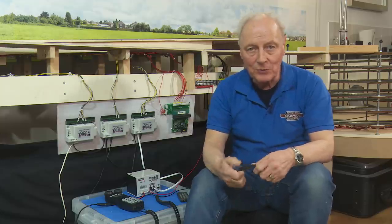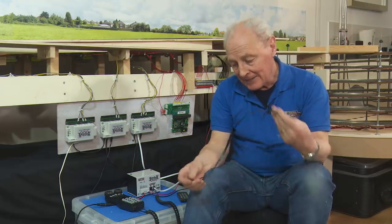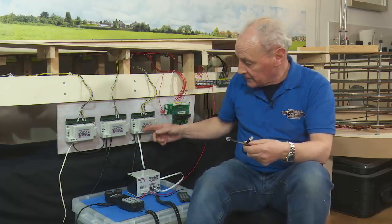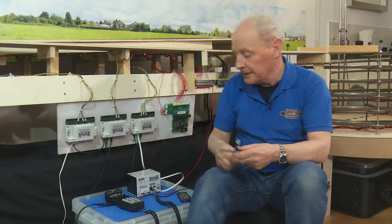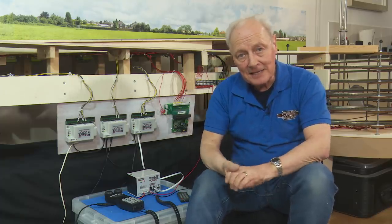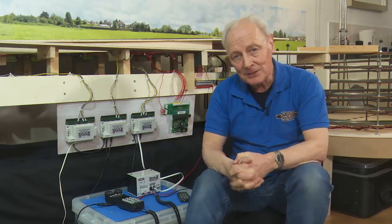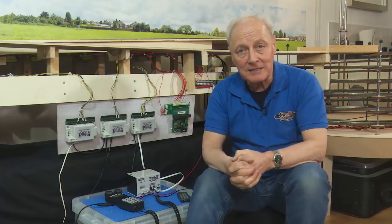You must be wondering whether it all worked perfectly first time out of the blocks - of course it didn't. I had a duff loconet cable: the cable that came out of the controller into the first DS64, where the signal is then looped on and on, was duff. That took me a while to figure out because nothing was working. And then running the locos up and down, they kept shorting out when they hit one of the live frogs - because I'd wired the frog the wrong way around. But we change it around, we live and move on.